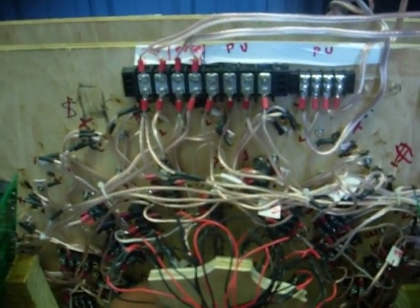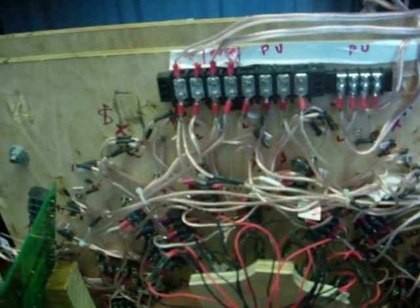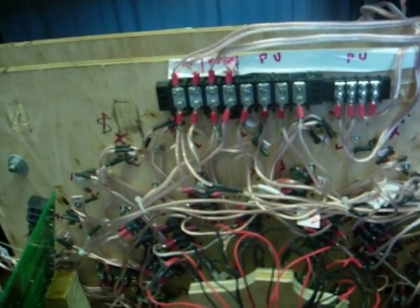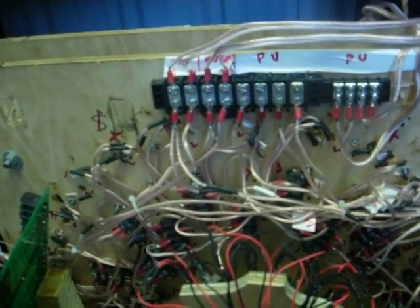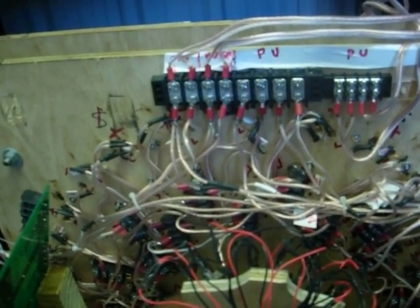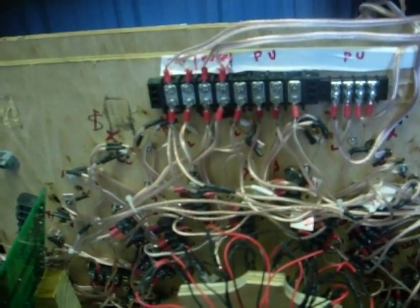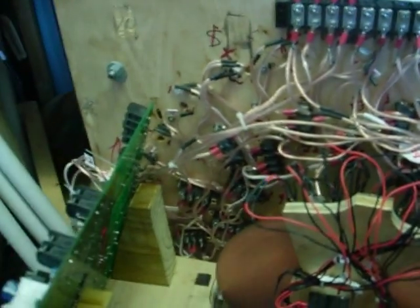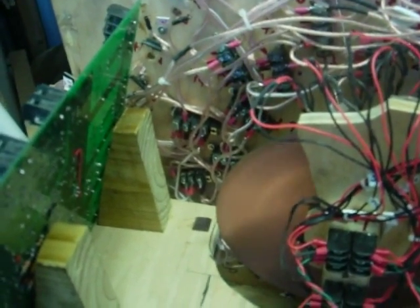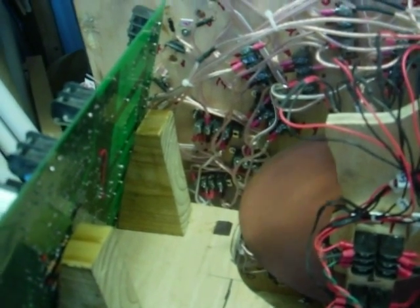That's how you get the first negative pulses going in, causing it to do a push on the magnets on the rotor. And the next thing that occurs is a pulse to the next set of coils. This design uses three pulses in a row — the original design was one pulse at a time. On the disc there are three pulses every 60 degrees.